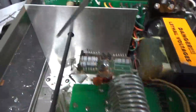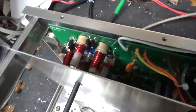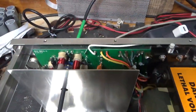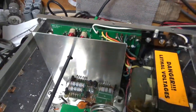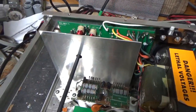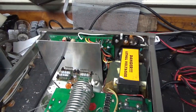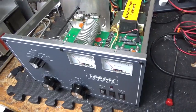I'm going to add gas discharge tubes at the base of the socket; there's one on the board, I'll remove that. Also needs new SO-239 connectors — the old ones have no grip, so I'll take those out and change those, and check the rest of it out. It's getting a brand new set of Penta 572B tubes — awesome company, great customer service. So I'm going to get to work, and I will see you guys soon. Stay tuned.